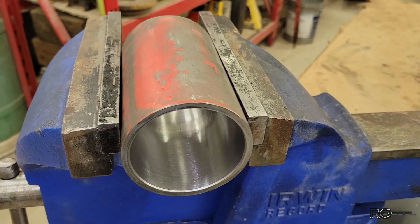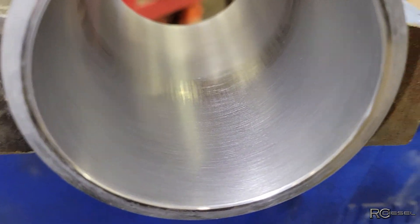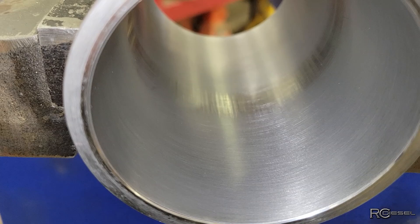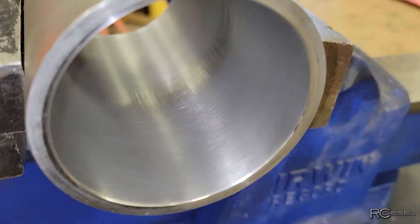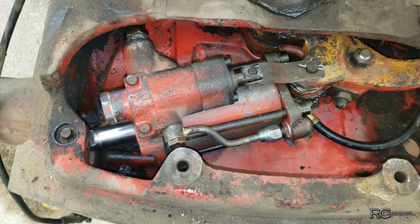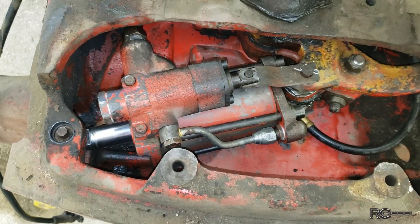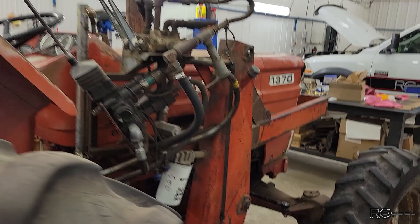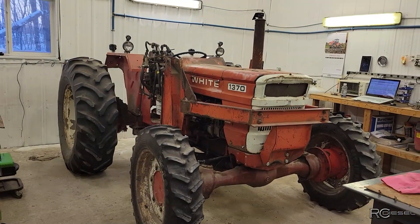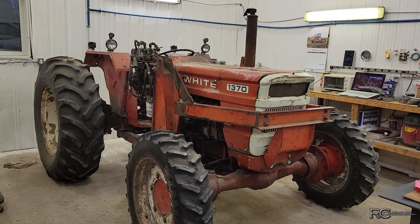Well there we go — gave her a good go with a fine stone. Still some pretty good marks in here but it's a lot better than it was, so we're going to give it a try. We got that guy back in there — I'll get this tractor fired up, work the steering back and forth, bleed the pump, fill it up with fluid, crank it from lock to lock and hold it to make some pressure and see if it leaks. Finally got this thing done — got that steering cylinder fixed in the front. Now this one can go home and do some baling or something.